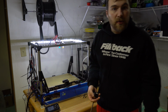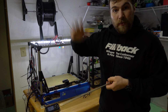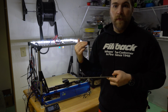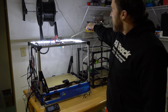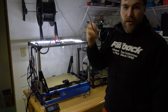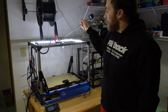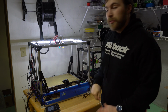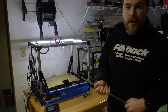It was the same thing on the MakerBot X2s, where even though it was a stable gantry and the bed moved up and down, one of the motors, I forget which, still would move in the X or Y direction when they moved. But the CoreXY will allow me to put a motor here and a motor here and a belt system that goes around. I'll probably have a picture of what it should look like. And then that will allow me to have a super light moving mass in the form of just the extruder. So I can choose to go Bowden, or I could choose to have a direct drive, take a little bit more mass, but yet have much reduced mass.